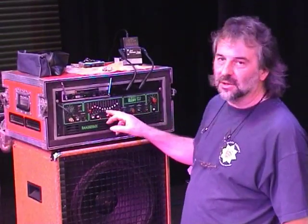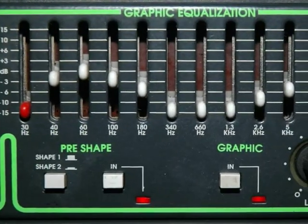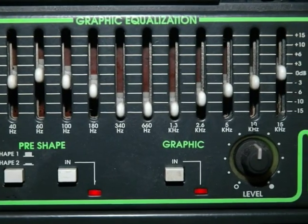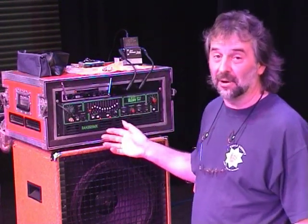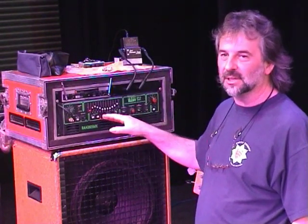This section here, the little row of white dots, that's a graphic equaliser. The graphic equaliser will allow you to actually pinpoint certain frequencies — it's not just a treble, it's not just a mid, it's not just a bass. Having said that, for bass guitar there's a lot of treble frequencies that you wouldn't ordinarily need, so this particular graphic is geared towards bass frequencies.